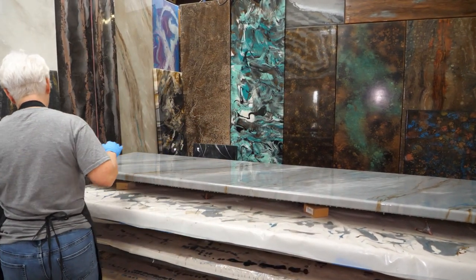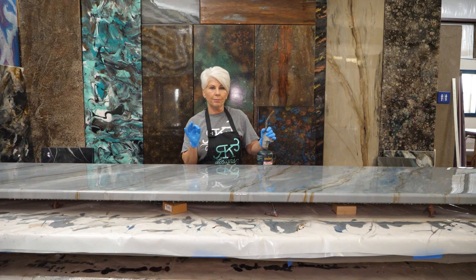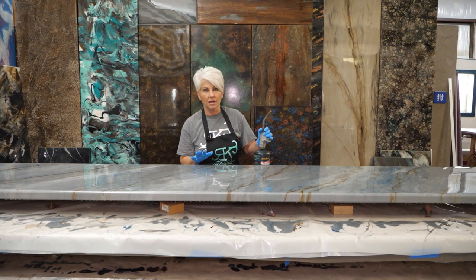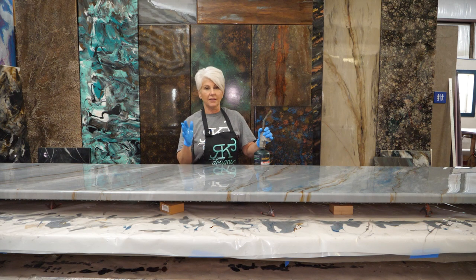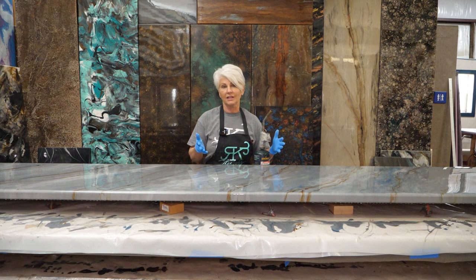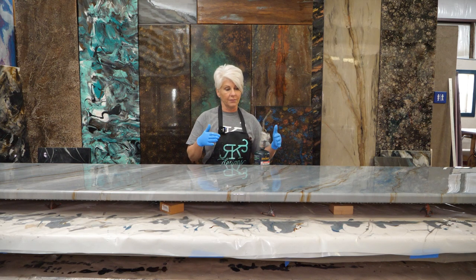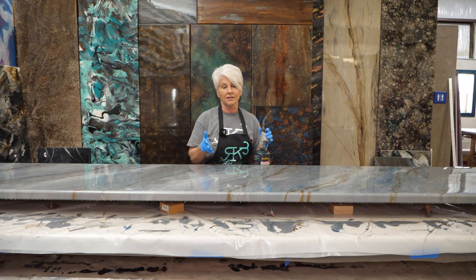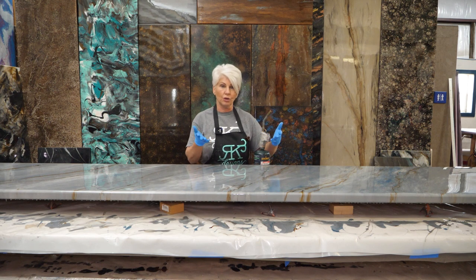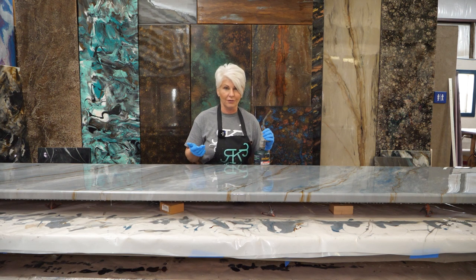All right, so it's very important to know the product that you're using very well. I use Stone Coat Countertop Epoxy. In my opinion, it's one of the very best on the market, and we've used it exclusively in our business. There are great products out there, guys, but not every single product is the same. Some products require spritzing with denatured alcohol instead of using the torch. So just make sure that you know what is required of your product.